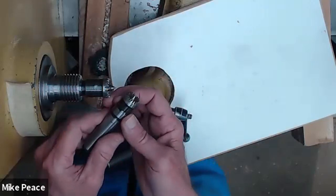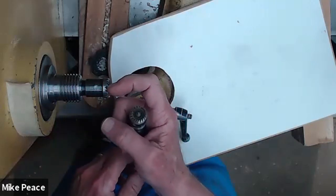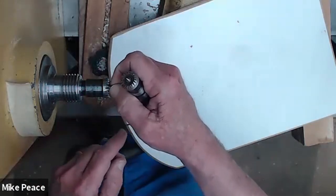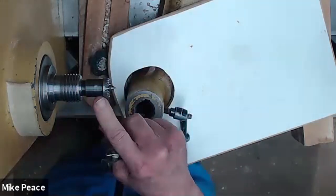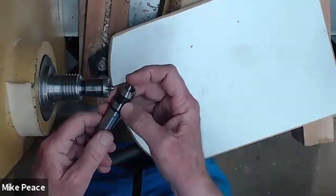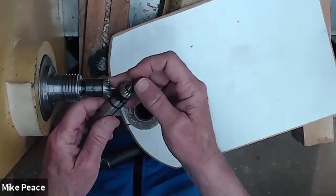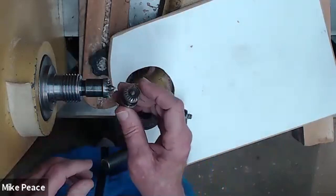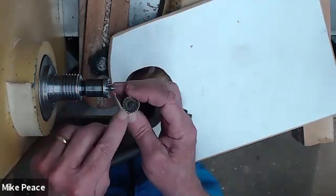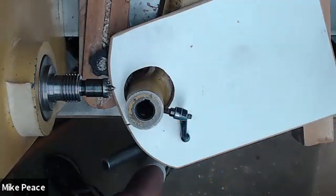This one costs 3 times as much as this one, and as a value proposition, if you turn a lot, you're going to more than get your money's worth out of paying 3 times as much, because they're both spring loaded, but with this one, no one ever has a problem. The spring is mounted in there in a way that's virtually impossible to get it out. This one is mounted with a spring. If it loosens, this thing comes loose. A lot of times you lose it, and it seems virtually impossible to get it to work properly again. We use this in my club because they're kind of a consumable product. They tend to disappear on us, but they don't hold up as well. The alloy is not as good. The teeth get duller than this, so I really recommend the Sorby one.